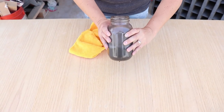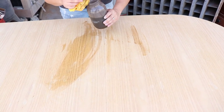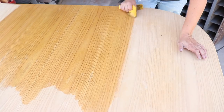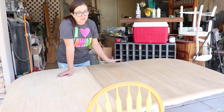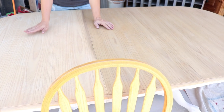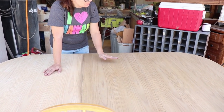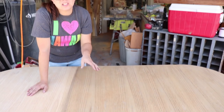Do you see I don't have gloves? That's because Real Stain is water-based and all natural — it washes right off your hands, no harmful chemicals. I want to show you the difference between the original finish, what it looks like sanded down, and what it looks like with the 50-percent-watered-down Real Stain. This chair shows the original yellow ugly oak finish. On this side I haven't stained it yet — that's what it looks like without stain. On this side you can see it's kind of grayed out but still light — that's Real Stain Number Two watered down 50 percent. I'm probably going to put one more coat over to richen it a bit, but it's a great way to get a light-toned gray wood instead of yellow.